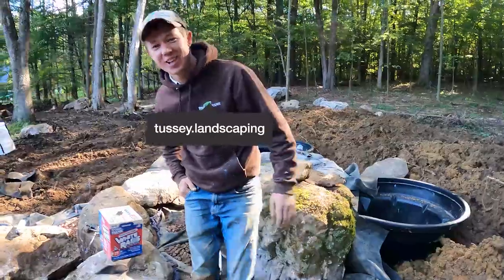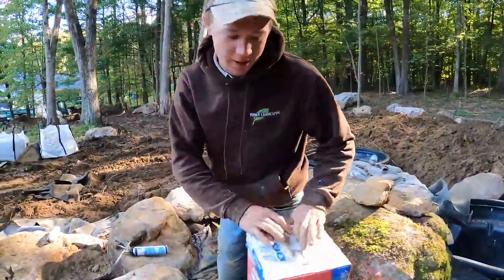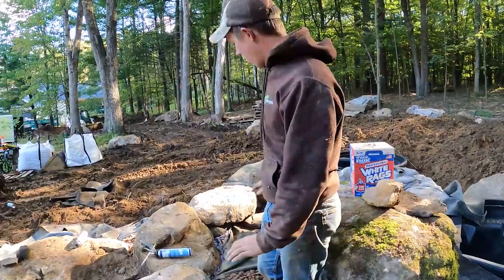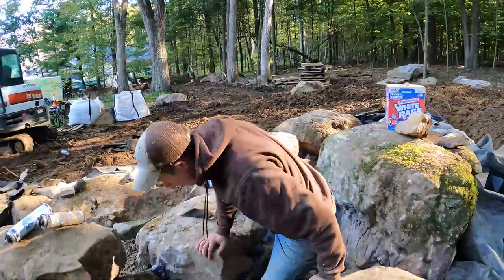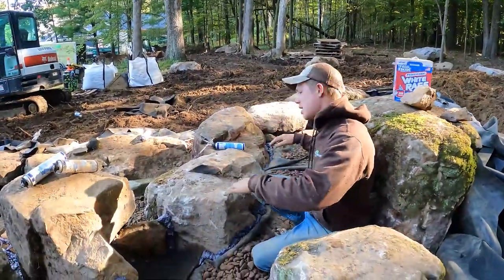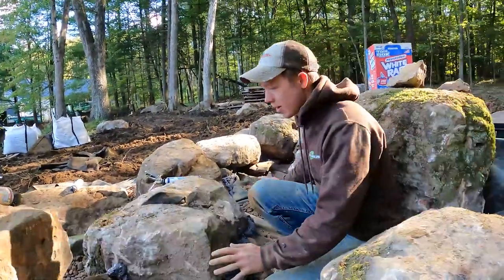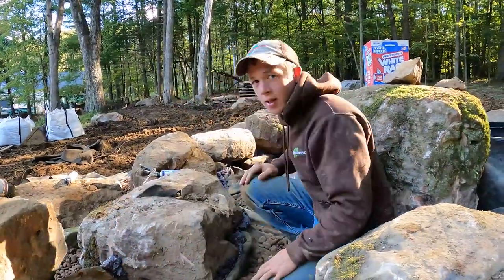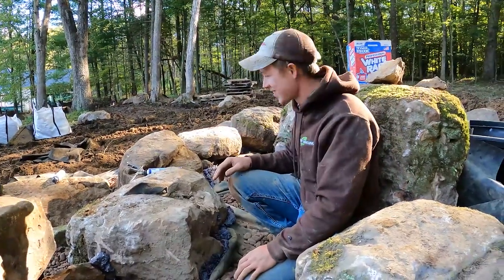I figured I could give you guys some tips on how we foam waterfalls. This is a very, very important part of what we do. Foam basically is not waterproof, but it forces water to places. It's what keeps all the water from going underneath our rocks and makes it go over the top of spillways. I had to think about that for a little bit because I thought it was backwards at first.